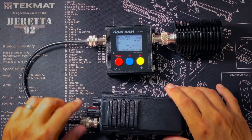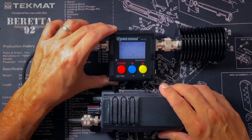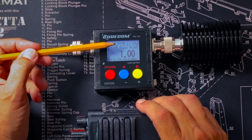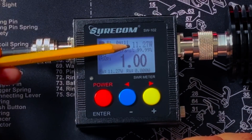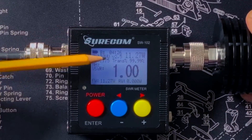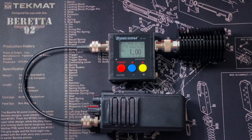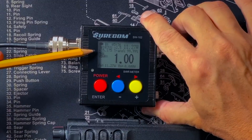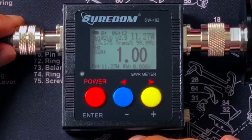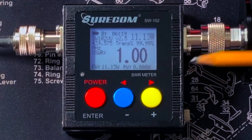But to use the SW102 is very simple — just plug it in. With the dummy load connected and rated for the proper wattage, we press the transmit button on the radio. We've got the power output reading at 11.27 watts, showing the SWR as a perfect 1.0 because we've got the dummy load on instead of an antenna. It also shows the forward power amount. One other really neat thing this meter does — it shows the frequency. It's got a frequency counter built in, so if I change the channel and press transmit again, you'll see the frequency changes. It tells you what frequency you're transmitting on.